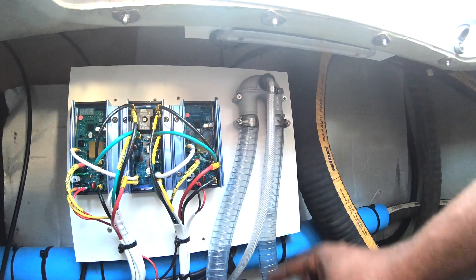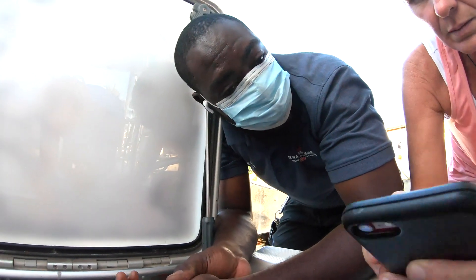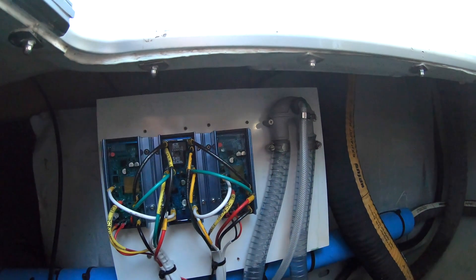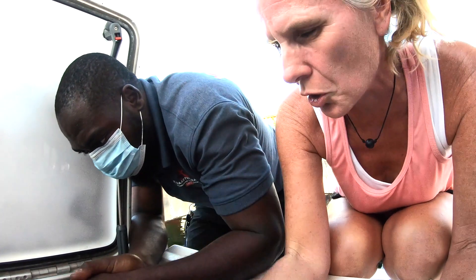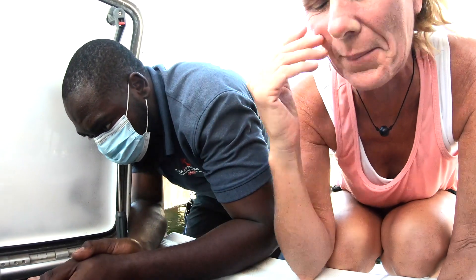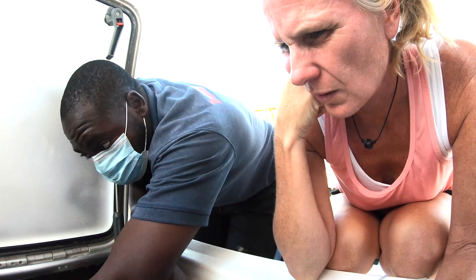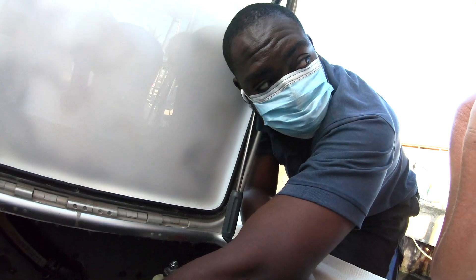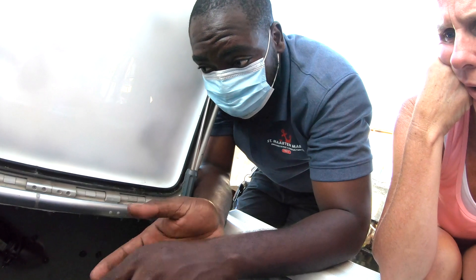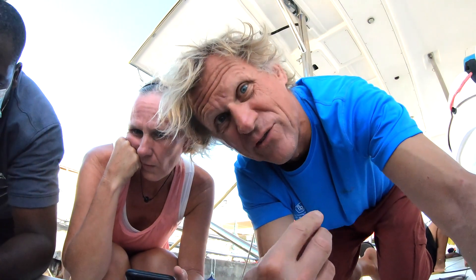By doing that — regardless of how hard it's spinning — there's no way you can ever fill that out. Because what would happen is this side vent makes the whole system such that the engine is way higher, making it very difficult for that to ever happen. That's the reason I like to install clear hose on this, so you can see it. It basically stops the water from going one side to the other — it's just a vent. That's the whole purpose of that valve. It's very important not to ever close that end of the hose, because if you close it, it's like you never had a vent. I've seen a lot of people make that mistake where the hose is hanging in the bilge and water clogs it — and then it's like you don't have a loop at all.